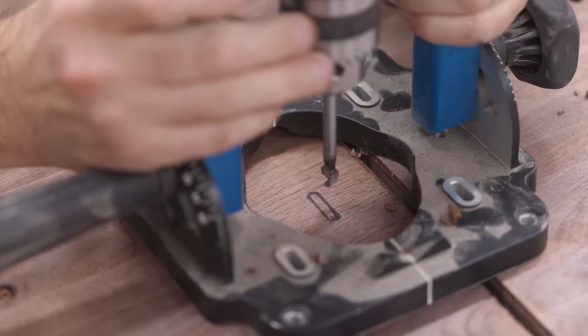This here is the last remaining piece of that original slab and I'm using it to create a little shelf inside the tambour cabinet. This shelf will hold the computer, and below it will give me space to slide in a keyboard and a trackpad when I'm not using it. The back end of the shelf has two slots to allow pass-through of cables without interfering with the tambour door as it slides around the back. After a bit of resizing the legs and adding a round over I can glue up that shelf.